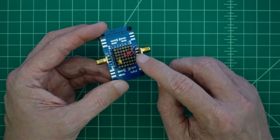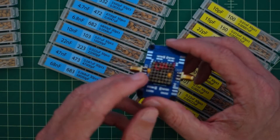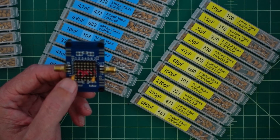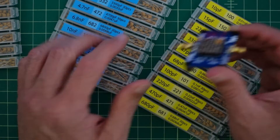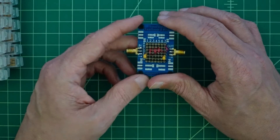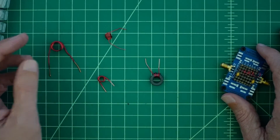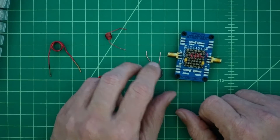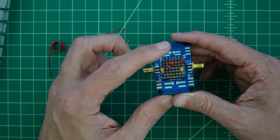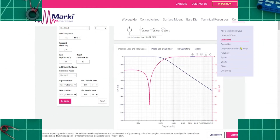When I went to build this I didn't have the exact capacitor values. It was calling for 20 pF capacitors for the shunts. The closest I had was 22 pF, but when I started to measure them on my meter they were coming out at 17 pF, so I found two that were 18 pF and that's what I used. I knew I was going to be off a little bit. The inductor is super low inductance, so I just started rolling coils, adding and removing windings. Because the inductance is so low I had trouble measuring it, so I just put one on there, added and removed wraps until I got the curve to look right on the trace, then spread them out a little bit — compressing or expanding the coil changes the inductance value.